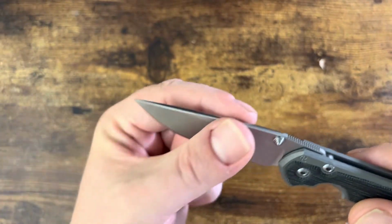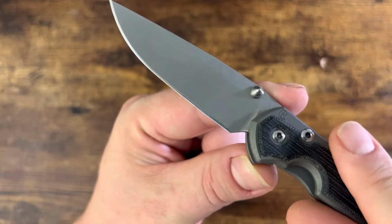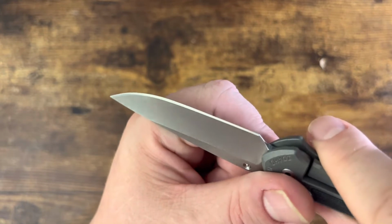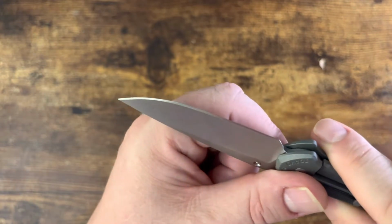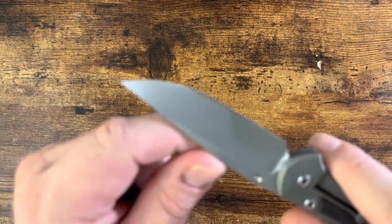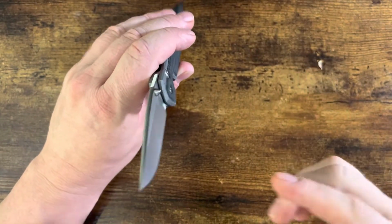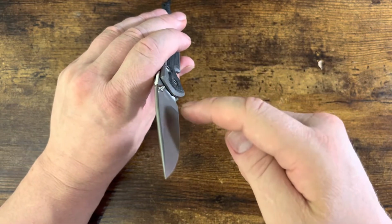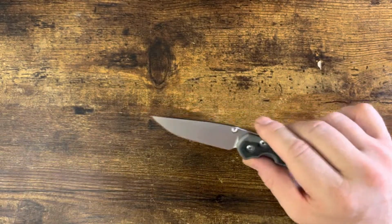The high saber hollow grind. Let's see if you can see. Do you see the changing shine on that secondary bevel? See how it maintains that shine as I roll it through multiple angles. That's indicative of something you normally wouldn't see. That is a convex secondary bevel on a hollow grind, which actually gives you an S grind, where you go in and then you get down to the edge, and then it's in and then convexes out to the edge. That is honestly my favorite geometry ever.